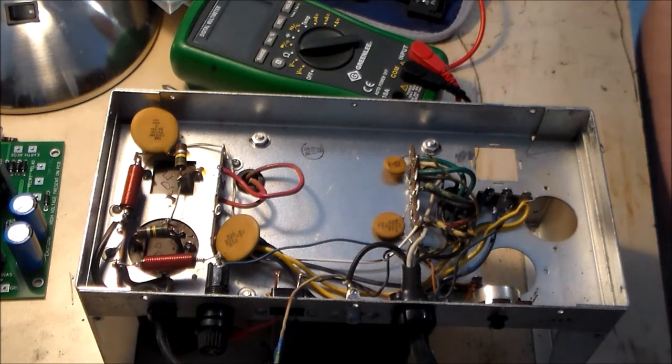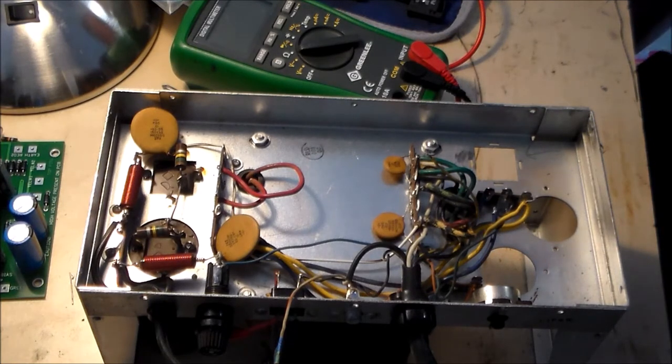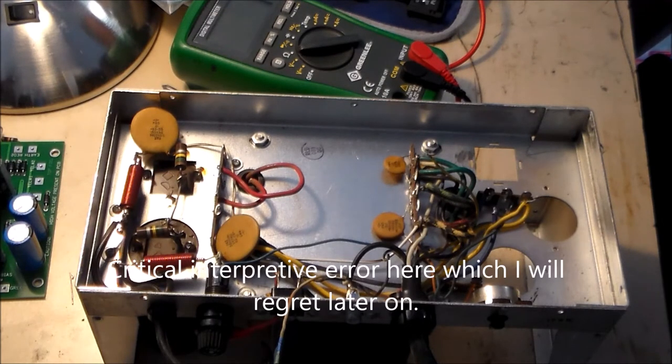In this step, you will move the unattached large yellow wire to the empty lug on the solder strip that holds the two large red wires. Do not cut this yellow wire. Take the unattached large yellow wire and place it on the second solder leg from the left. This terminal strip should now have, in this order, from left to right, capacitor to ground lug.